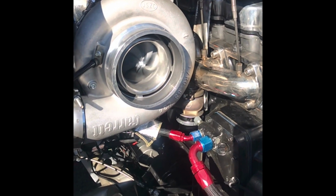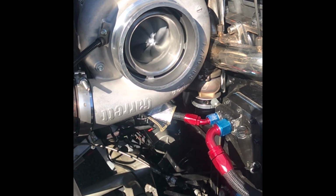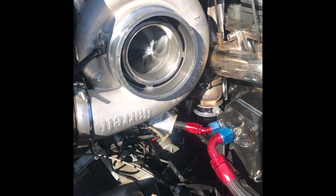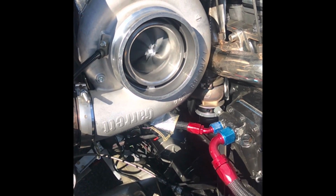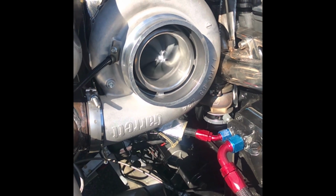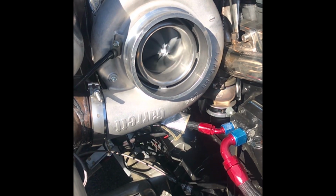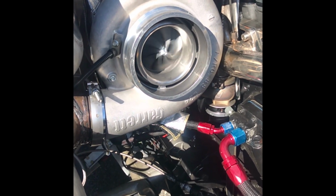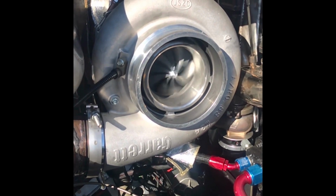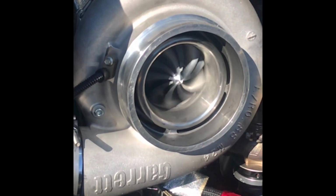All right, guys. So that was analysis of one of our S400 units, BorgWarner based, and then we put our 5-blade Mafia compressor wheel in it. This one is a Super Core unit, which we sell with a modified BorgWarner turbo cover and our 68 millimeter compressor wheel. This one in particular had an 83 millimeter turbine with a little flow clip on the turbine side. As far as the application, it's 600 to 800 horsepower range at the tire.